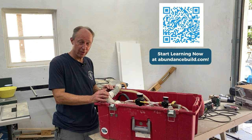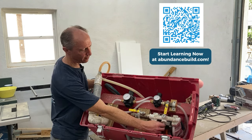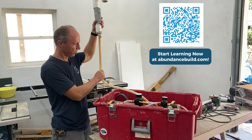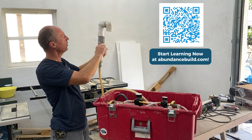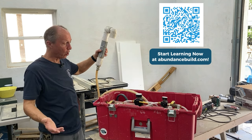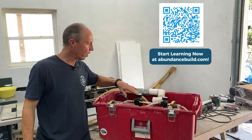I had to make a foam generator and I've made maybe four different ones. This is the latest one — the last one I did — and this one runs entirely on air. It has a diaphragm pump to pump the fluid, and then you've got compressed air powering the diaphragm pump as well as blasting air through the nozzle. You're mixing air and fluid through here, with all your stainless steel scrubbies inside, and you end up with foam coming out. I've got magnets strapped here so I can put it right up against my mixer — it comes over the top and dumps right into the mixer so I don't have to hold the thing. It has regulators so I can regulate the airflow and pressure for both sides: the air pressure going in as well as the flow of the fluid.